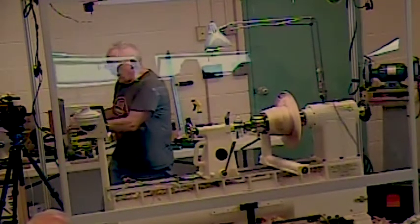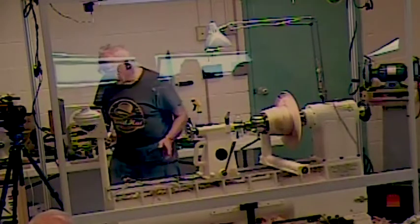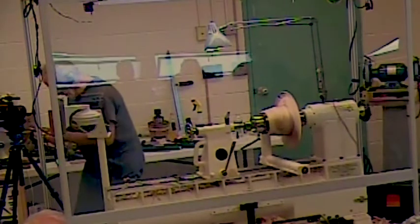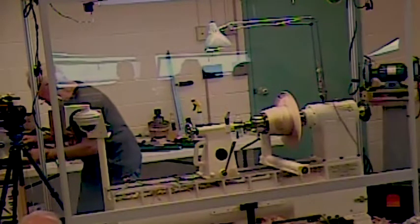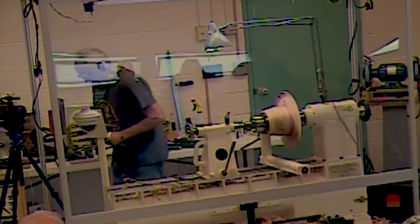These are, without question, the single most wonderful thing that happened for wood turners ever. Other than the lathe, I guess. So left side for left, and roll over the nose again, very lightly, just barely touching the wheel. Super sharpness. That's all it takes.